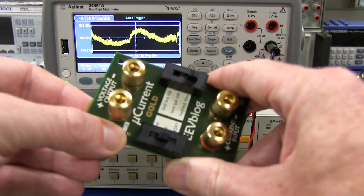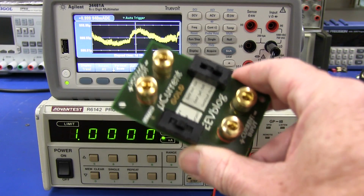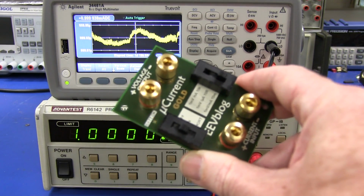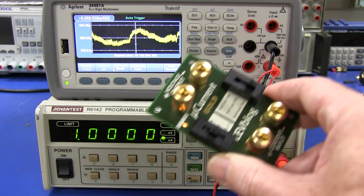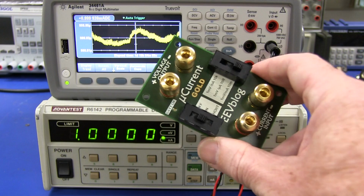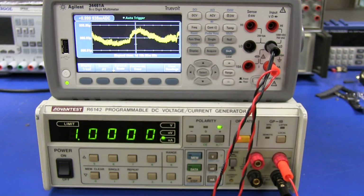You notice my battery letters flash in there. That's a feature, of course. The battery is of course low, so what it does, that's just the ESR of the battery there. When it turns on the LED, of course, it draws more current, which then drops under the voltage threshold of the comparator there. Really quite a neat little unintended side effect there, but I like that feature.